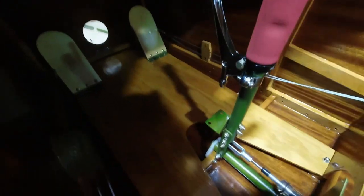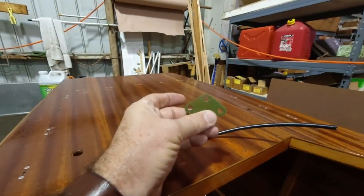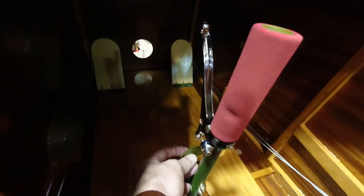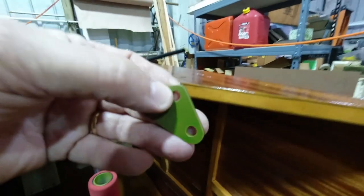I went ahead and put the brake handle on right here, and the way this works is you have this, which evens out the pull, and you have some 16th inch cable and some 16th inch thimbles like you saw me use on the other cable. So this goes down here, and the cable comes up and attaches right here, and it goes to this top one, and then each of the two bottom ones go down through this bracket where the cables mount to that bracket, and then they go down through the floor and out to each of the respective brakes.